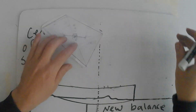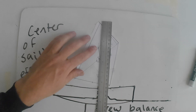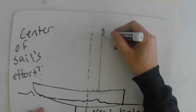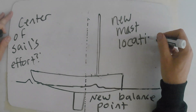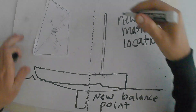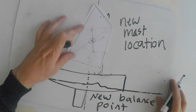So now we've got the center of effort of our whole odd-shaped four-sided sail, calculated at 69 square feet. I'm going to cut out a paper version, hold it up on my crude whiteboard drawing, and move it around to put that sail where I want that center of effort balanced. Then I know where to draw the mast to hold the sail up so the center of effort is where we want it, which should make this boat sail to windward pretty well and balance everything out even when the boat heels a little or the sail is eased out to the side.